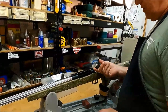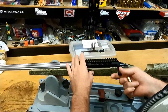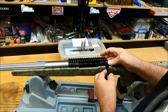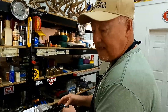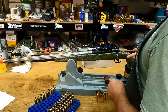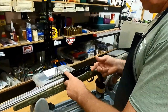Watch — it just drops right in. The handle just drops right. I already went through all of these, and that's why we're making the video. You can grab this and feel how much movement there is beyond the brass itself. I could put those shims in there on the brass since the brass is slightly smaller than the headspace gauge. I went through all these and they all close the same — though you can tell there's a little bit of difference even among the ones where the bolt drops.